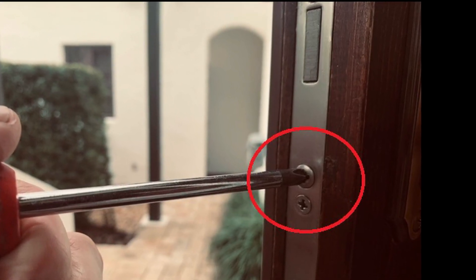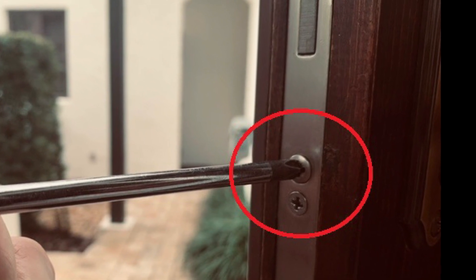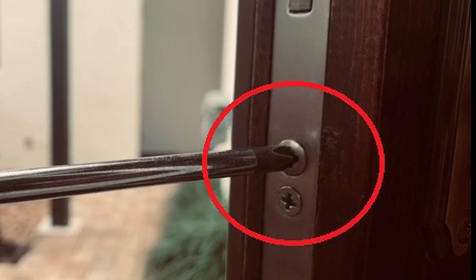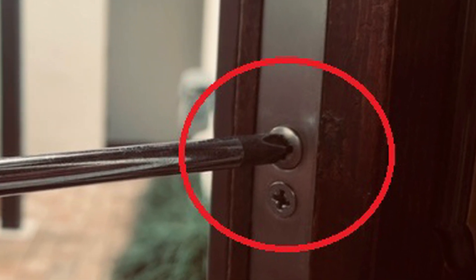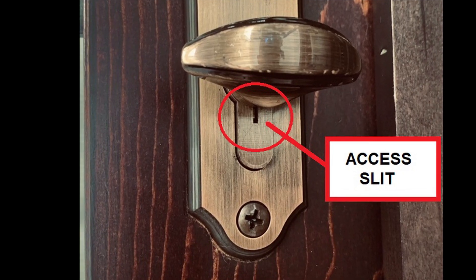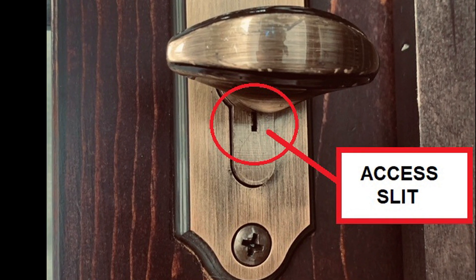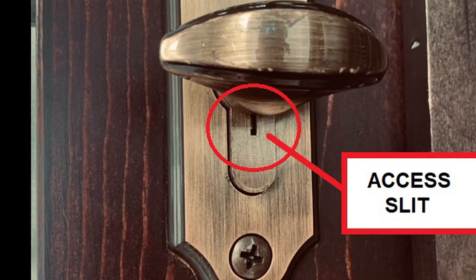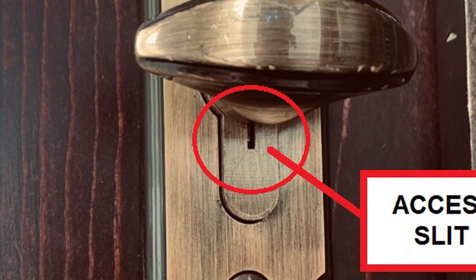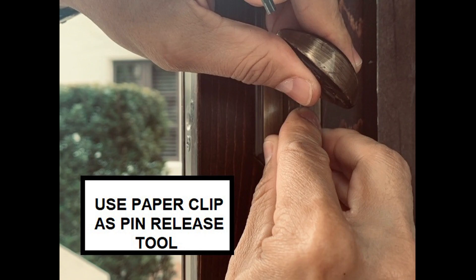Let's get started and take out that lock. The very first thing you want to do is open the door. Below the deadbolt, you'll see a round-head Phillips screw. Take out your Phillips tip and remove it — that's a machine thread screw that holds your profile cylinder in place. Take it out and hang on to that screw. Now look on the interior underneath where the thumb turn is — you should see a slit there. That slit is a restrictor pin, and that's the release.